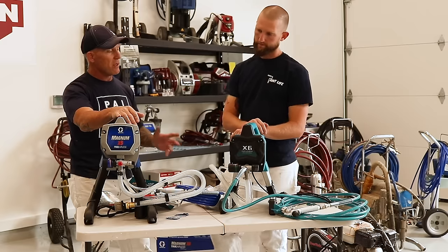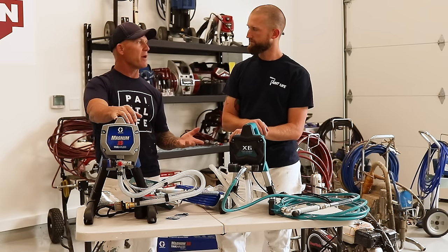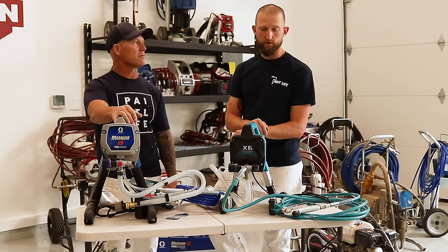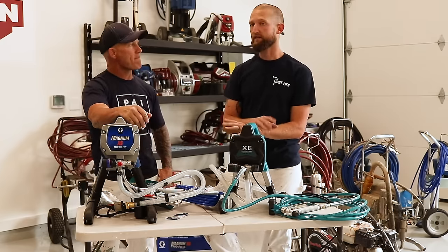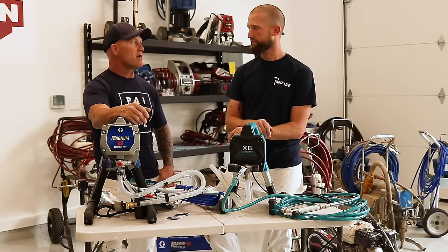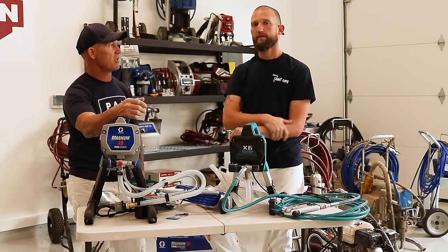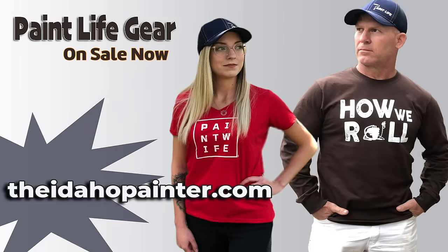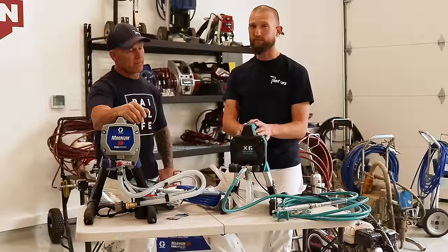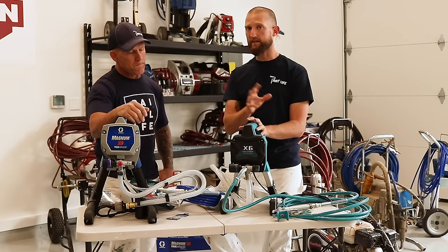Hey, if you needed to spray a door, if you needed to spray your exterior — yeah, totally. You could probably spray one exterior and a fence, maybe a little bit more. It's going to spray an airless finish, but I think there's going to be a difference in quality. You're not going to be able to achieve a really fine finish. It's going to be slower. You're going to be limited to a smaller tip size. Both of these things max out at like a 515 tip. You might be able to run a 517 off of this one, but it's going to be everything this pump can do to keep up, and you're going to have to move quite a bit slower to get a good finish.